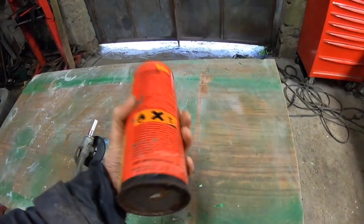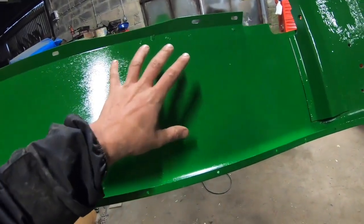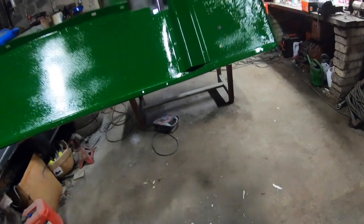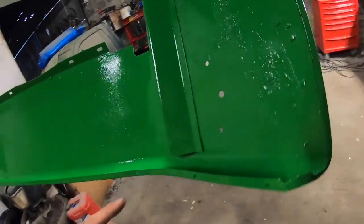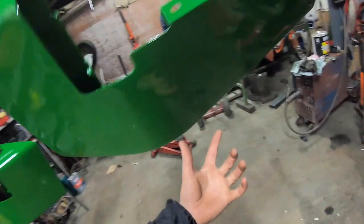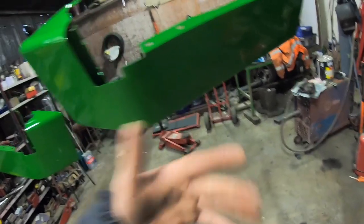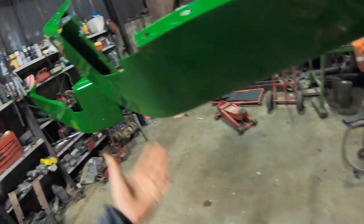Now this, a lot of people make a mistake putting this on. If you have a little bit of rust on the surface of a body, let's say on the body of a vehicle, you actually manage to seal in the rust, which always holds moisture. If there's moisture underneath that underbody sealant, then you actually seal the moisture in and the metal will rust from the inside out. So where you'll actually get the rot will end up being on the other surface that's not covered with it. Or in other words, the floor, let's say, of a car will just pretty much fall out. It'll crumble into nothing because the moisture had been eating away at it inside all the time.